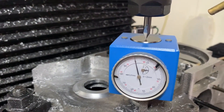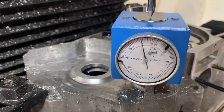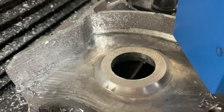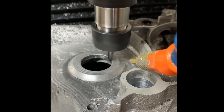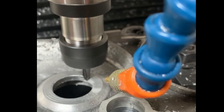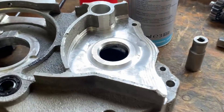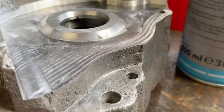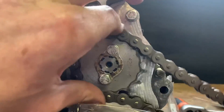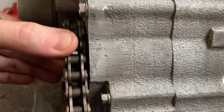I've set the Z for the 60-degree or 30-degree chamfer slash engraving end mill, and now we're going to put a nice little chamfer on that internal edge. At this point I thought, that is one hell of a chamfer — but because I'd already started and it didn't go all the way to the bottom I carried on, and that's why the footage there was terrible. As you can see it's pretty deep. I think that was a combination of a little bit of extra stock and the hole being undersized for the seal press fit in Fusion — but it worked out in the end.